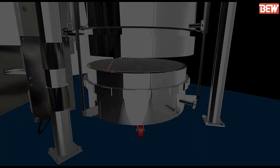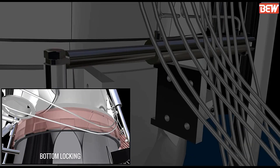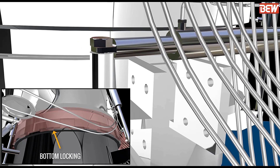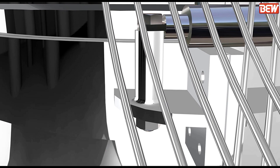While closing the bed, make sure that the clearance between the blade and filter cloth is 10–15 mm. The bayonet ring is used to lock the bottom bed. While closing the bayonet ring, the teeth of the ring and bottom bed body flange should be in line one after the other, to ensure smooth locking of the bayonet ring.